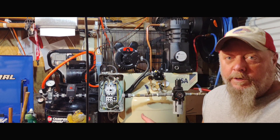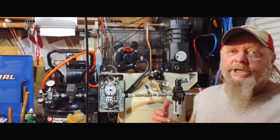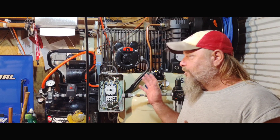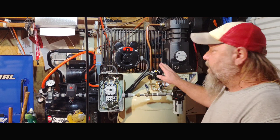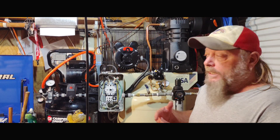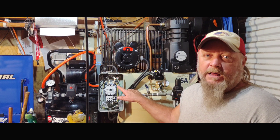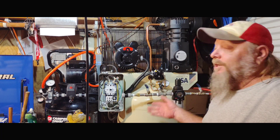It was kind of a short video, but it gives you an idea of what's going on. There aren't a lot of videos out there showing stuff like this. If you've got a Quincy or another compressor and you're burning the switches up, this is by far the easiest way to straighten that out. If you get your contactors cleaned up and install the switch, it'll last a long time. If you do need to replace the switch itself, it's around $100, and this magnetic starter ran me right around $75 - so this was actually cheaper than the switch they sell for the air compressor. Simple fix. Have a good night, and if the video was helpful, give it a thumbs up.